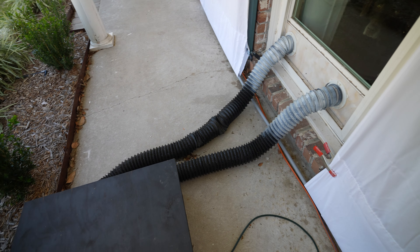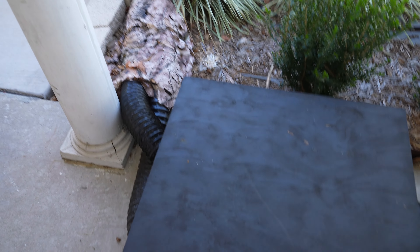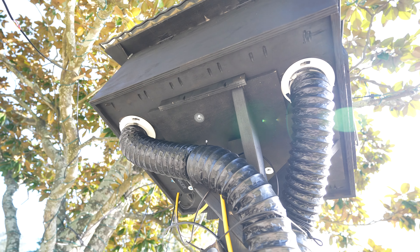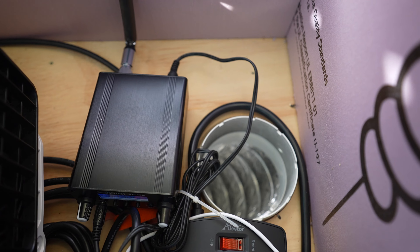Now for common questions. One is: why do you have two ducts instead of just pulling air from the house and pushing it out to the box? The projector would be totally happy with just one duct — it would get cool dry air and we'd vent the rest to atmosphere. But if I was only pulling air from my house and delivering it to the box, that would keep my house negatively pressured, so air would want to come in through every crack, door, and window. That's why I circulate the air from the projector back into the home — to keep it neutral, neither positively nor negatively pressured.